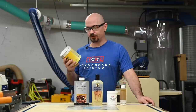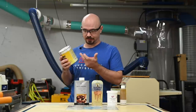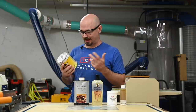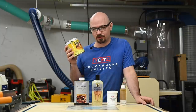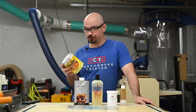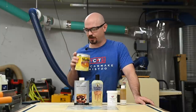But to help this dry and also to suspend it and emulsify it so it can be spread, this has ethanol, not something you want to drink, isopropanol, methyl isobutyl ketone. You don't want those things in your system, but you know what all those do? They all evaporate. And it has water too, which also evaporates. So the only thing you're left with is the shellac, which is safe. So this is probably okay.